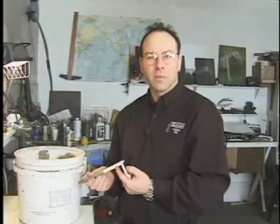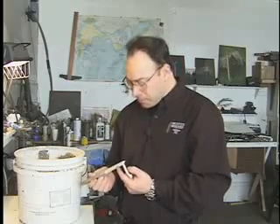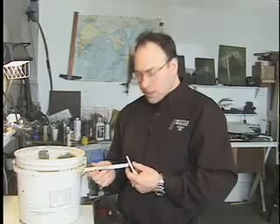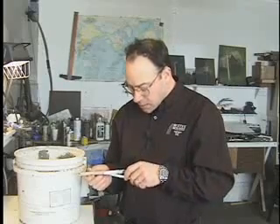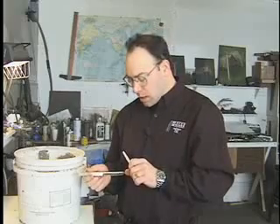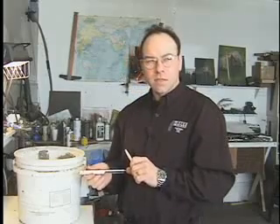That's fine enough. We'll finish grinding and polishing the blade after it's heat treated. At this point we're going to put the clay on the blade. The reason I do that is so I have a soft back and a hard edge, and that enables the blade to flex a lot more than if you didn't put the clay on. So it doesn't break.